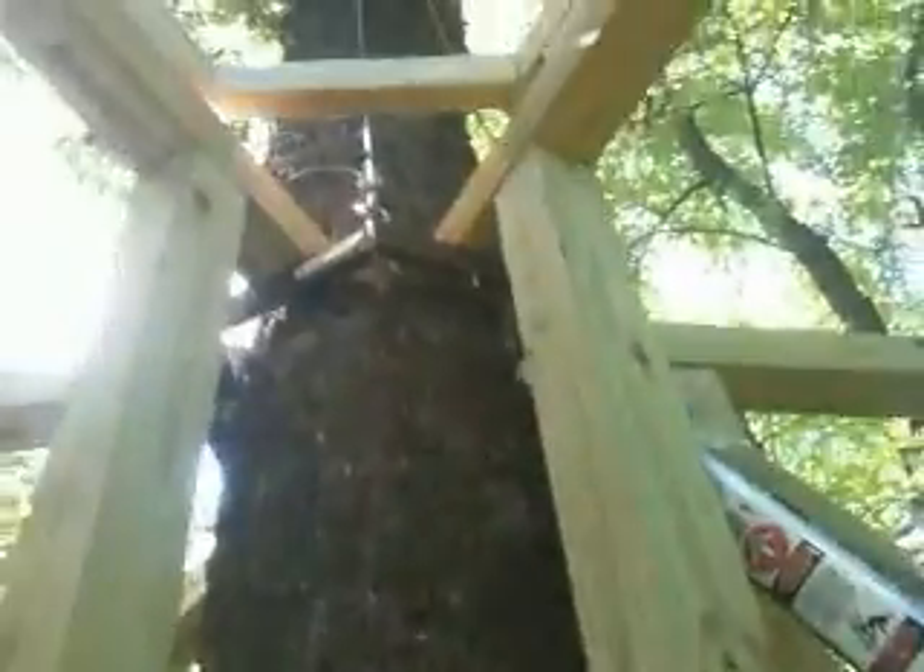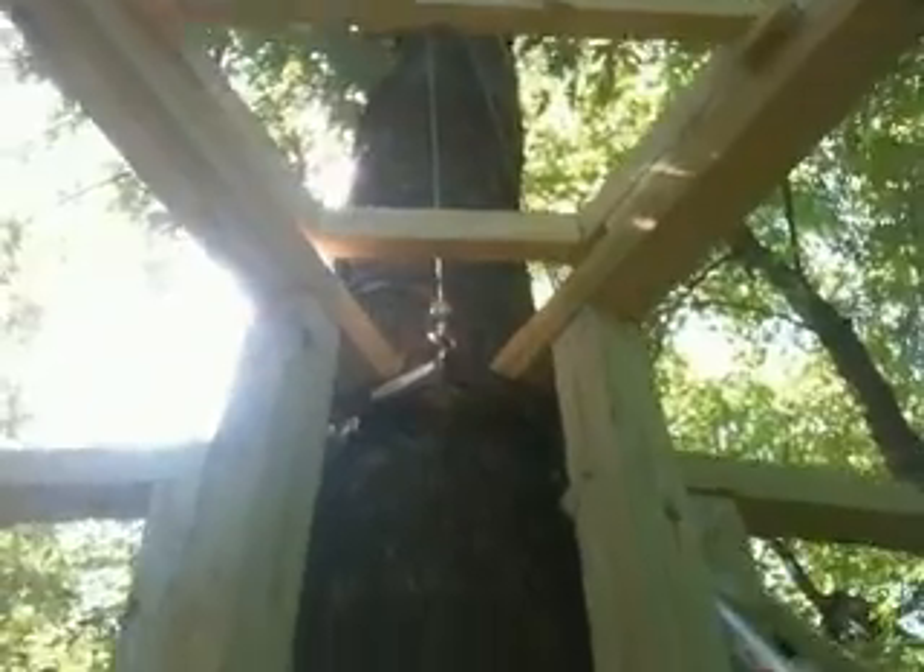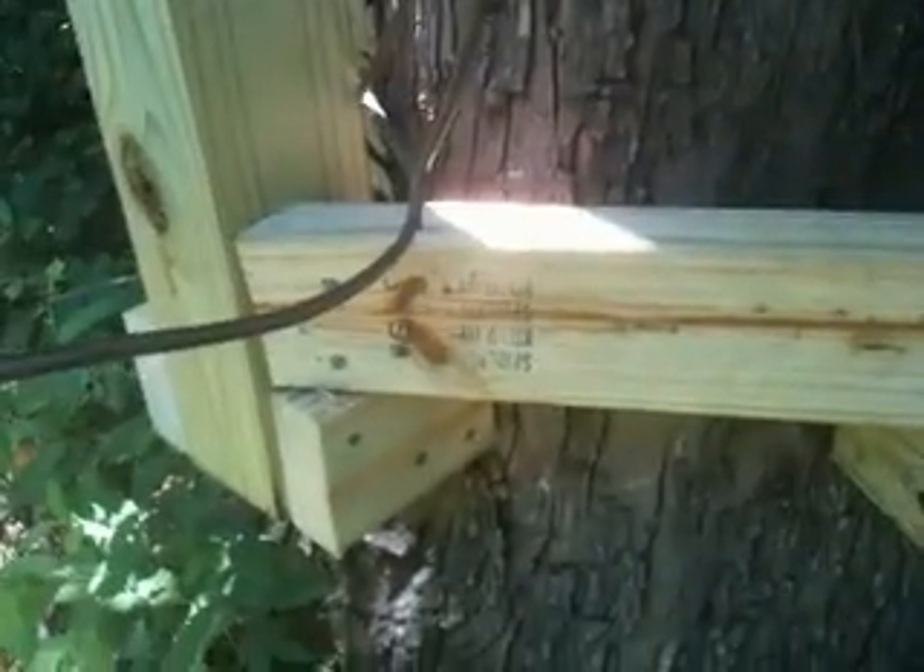And it's the trash treehouse continued. Got some more detail done. I've added down here the shimming — each one of these boards only took a single piece of 2x4 to shim it out. I attached that shim with a couple nails and side pieces to hold it on. Then I measured between the top of the 4x4 corners right up at the very top to see where the joists were installed. I took that measurement, cut a piece of wood right here — 15 inches — and nailed it in place to help stabilize the bottom and keep these legs from flipping out one side or the other of the tree.